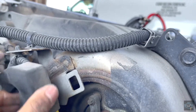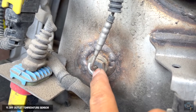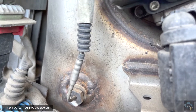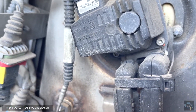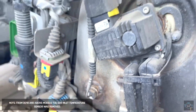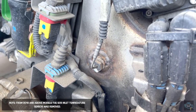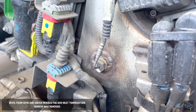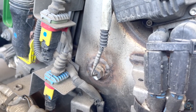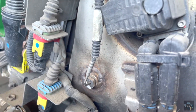You can see this is the DPF outlet temperature sensor. This box no longer comes with the SCR inlet temperature sensor — they got rid of that. If you check with a laptop you can still see the SCR inlet temperature reading, but I think they calculate that with an algorithm, which is why it reads on the computer but there's no actual physical sensor for it.